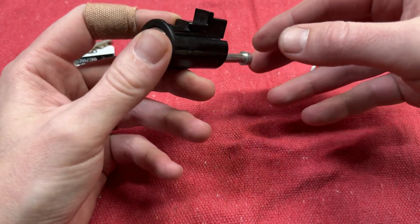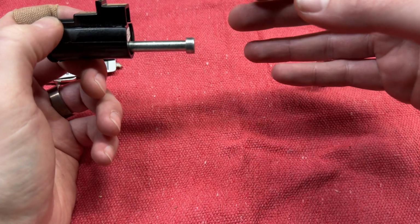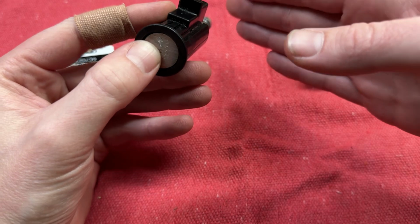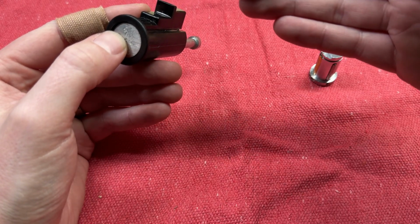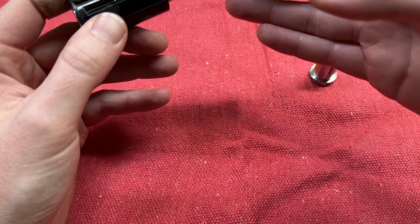Inside the top drawer on the right side, this post will interact with kind of a pawl-like mechanism that's spring-loaded. When it's locked, you're pushing against that spring, which in turn will raise a bar to lock the topmost cabinet from the bottom. When that's unlocked, it springs down.